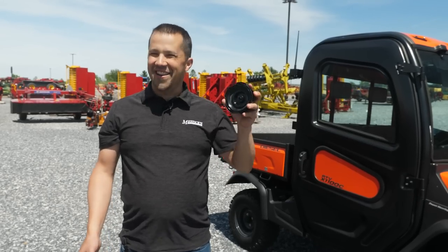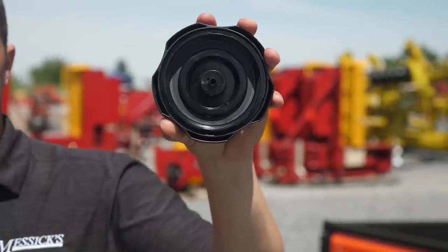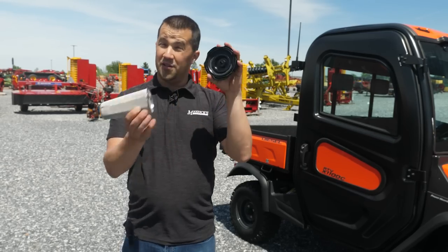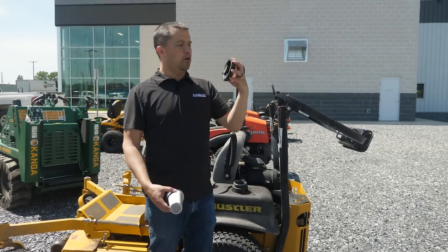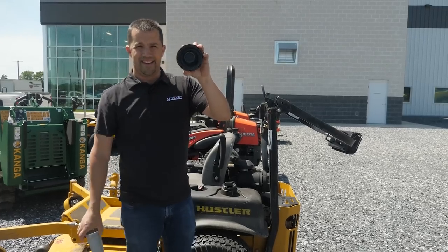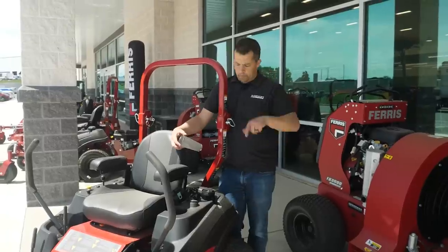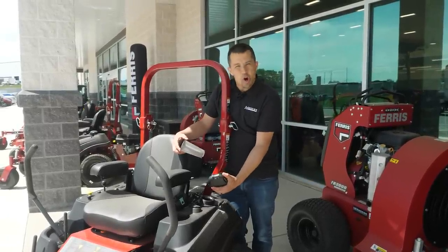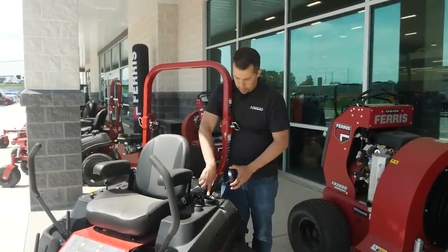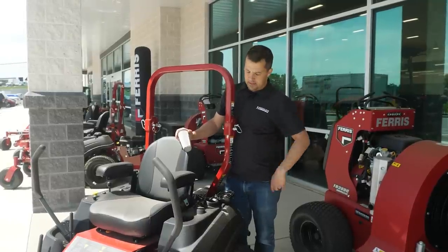We're going to keep going and give you examples of as many machines as we can so you don't waste money on this if it doesn't fit. This is the fuel cap off of an RTV — the mechanism is a little higher up in the cap, and this fits underneath just perfectly fine. My old used Hustler mower would also work just fine — you can see the assembly leaves plenty of room for it to slide up inside. The Ferris walk-behind mower cap works out just fine too. However, all of our new Ferris mowers out here use this same large three-inch fuel cap, but these do not fit — the fuel neck itself is smaller than on most of the other machines.